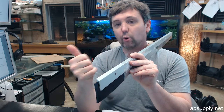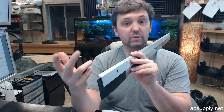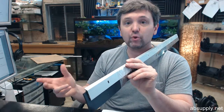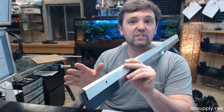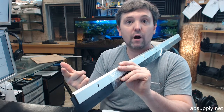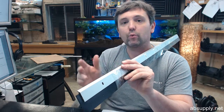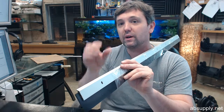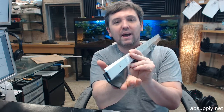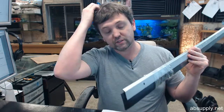Where I would use this would be a door that was not fire rated, because I wanted to be sure that my hardware was going to seal every time. I'd probably use this on the back wall of a big box store where there are two or three pairs of doors on a 100,000 square foot building that are emergency exits — hardly ever used except in an emergency, or to test the hardware maybe annually. Positive complete seal is what you want. You're not really concerned about the functionality of the door being delicately capable of feathering itself closed — you've got a lot of neoprene to bend. Why you would use this might also be an unusual undercut, etc. Lots of applications.